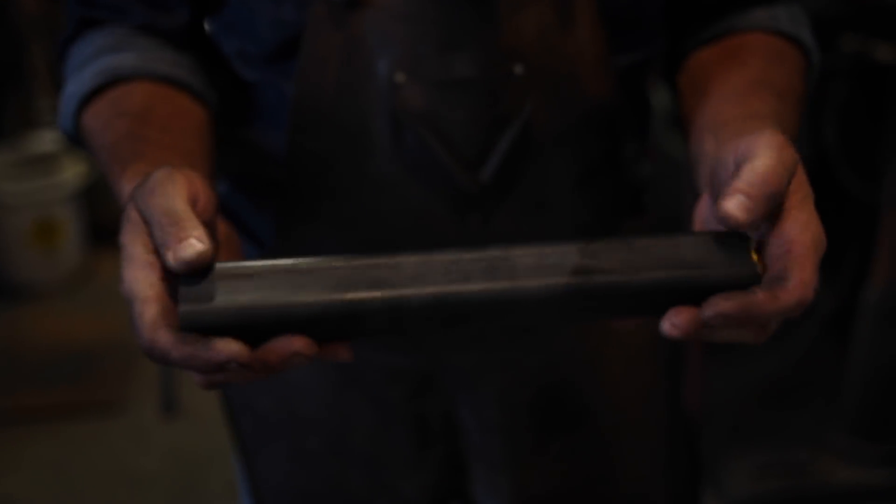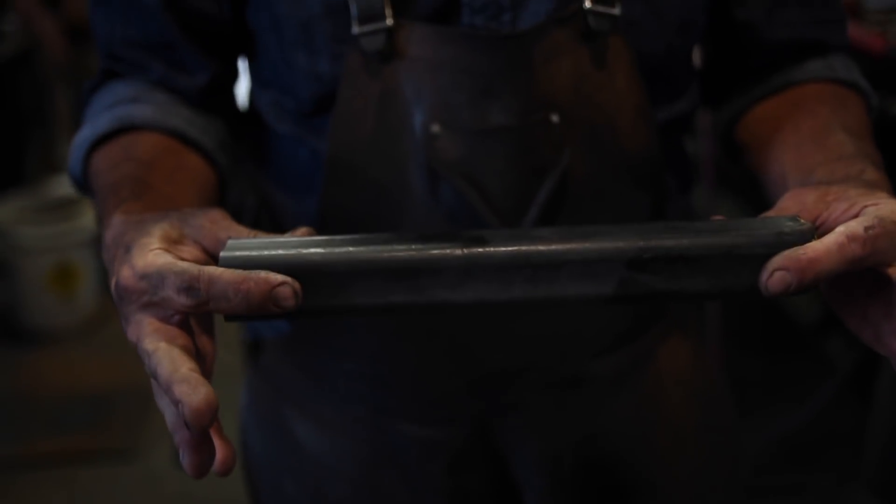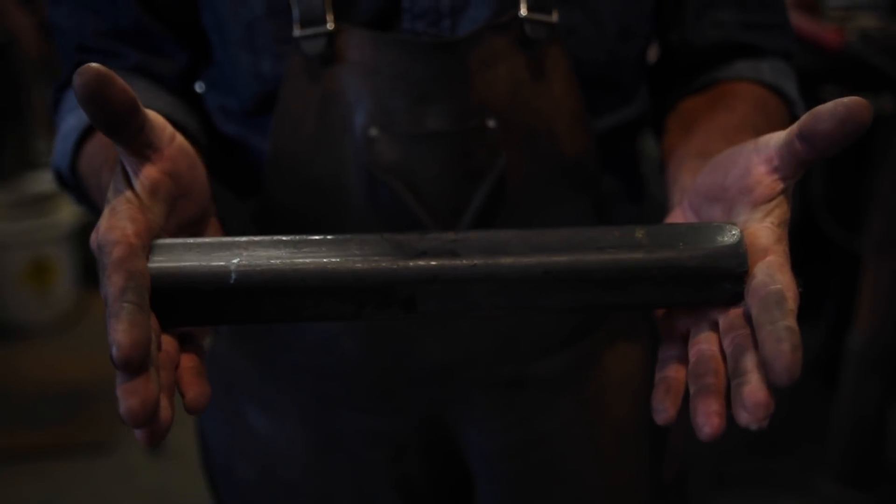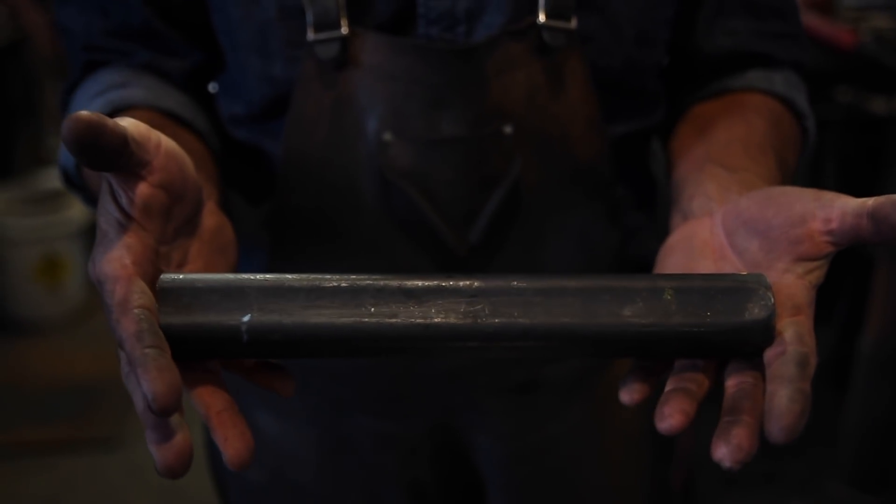Atlantic 33, also known as Flutagon or A33. This is a water hardening, non-tempering steel. You make your tool, you heat it up to like a bright orange and quench it in water. That's all you got to do.